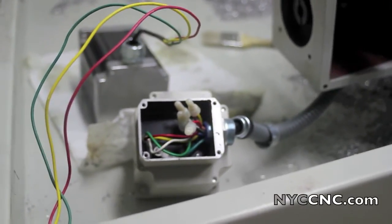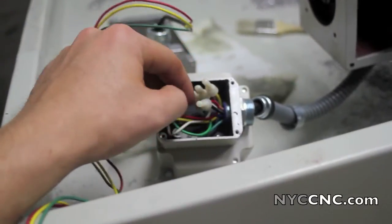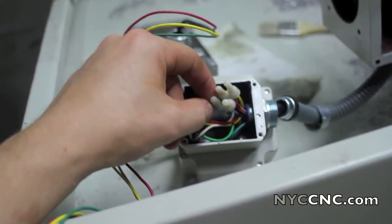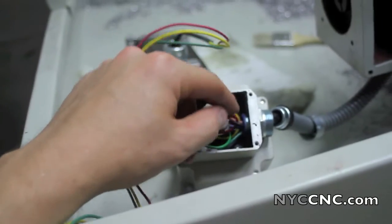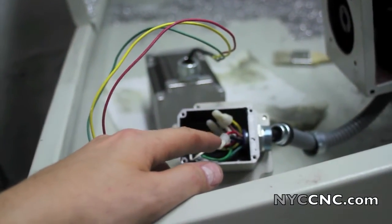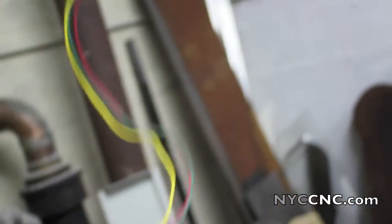I've got the Z-axis stepper motor off and the back panel off the motor. The instruction diagrams show a terminal block set, but I've actually got crimped-on twist connectors. It doesn't actually matter because what you're doing is cutting these and then using the old wires running through the conduit all the way back to the control cabinet as a pull string for the new wires. In other words, the old wires are junked — you use them only as a cable puller. The whole length of the new stepper motor wire will go through and plug directly into the new driver in the cabinet.